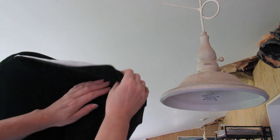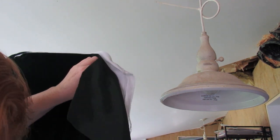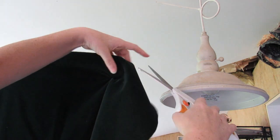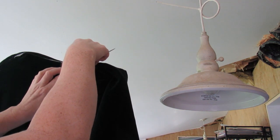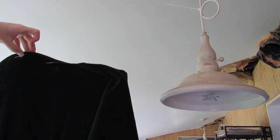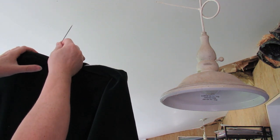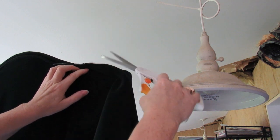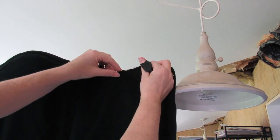Before I put this second side in, I've unhooked it and readjusted and pulled it out a little bit further and up. I'm just going to pop that back down to hold it for now and shut it. I know it's wrinkled but that will all go. Find the top and then cut all the way along. Using my fingers I can find the top there. Pull both pieces of fabric just slightly out and up and start putting those in behind here and work my way across — and it might not go in the first time, so ease it in. I'm using my fingers to pull this up so I can pop that right in there.